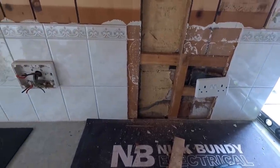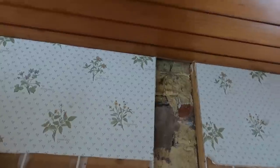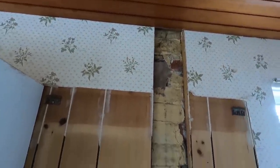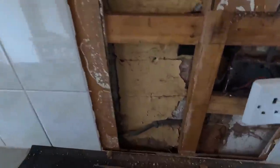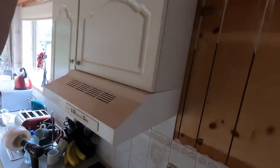We found right there is the earth running to the oil or gas - that's what it used to be like way back in the day. We're going to put the cooker isolator here, just working the hob. Normal double socket's going to go there. We found the cable that traces across to a double socket in there, which then goes across to here. We're going to do one for the extractor - a single socket up top, bring it down into a cross, down and around, get these ones up.